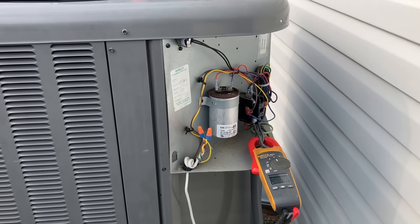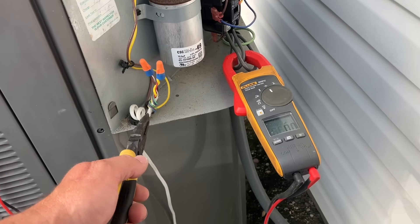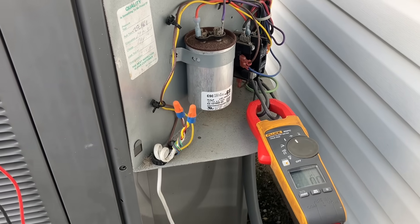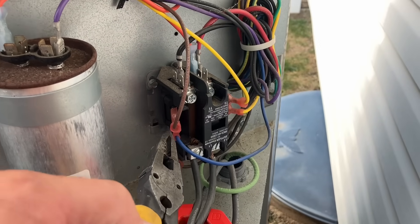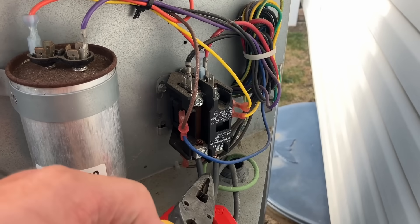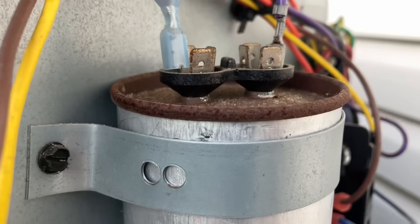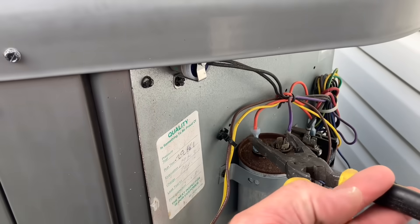That's no bueno. I remove the electrical compartment access cover, exposing the control wiring coming from the thermostat and the air handler — we have Y and C here, 24 volts. When there's an active call for cooling, this is our single-pole 24-volt contactor: 110 volts plus 110 volts equals 240 volts, powering the condenser fan motor and the compressor. This right here looks slightly pregnant — just a little bump in her belly — that's the capacitor. Let's discharge it.